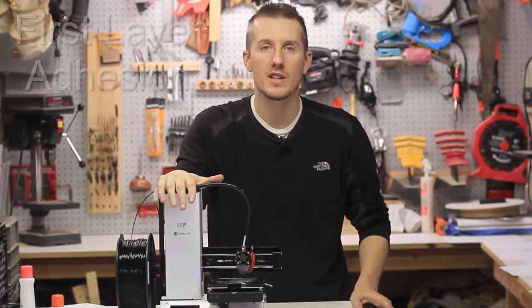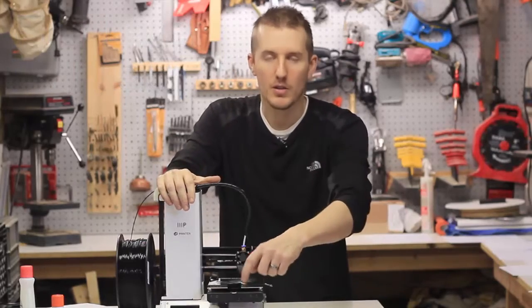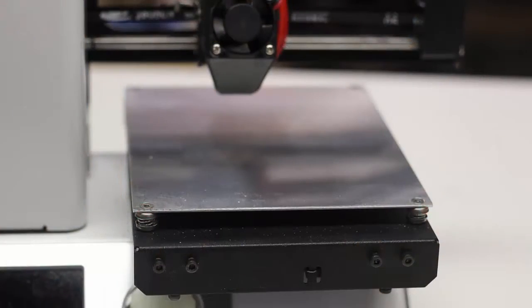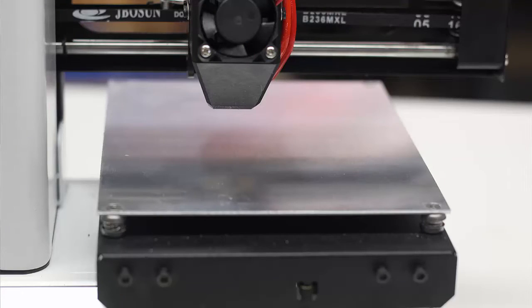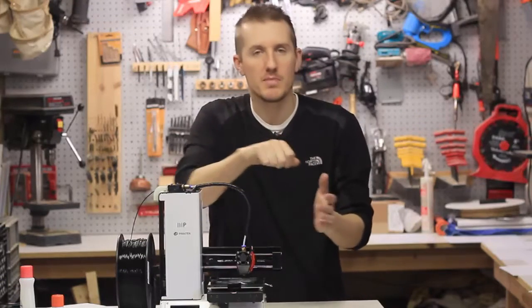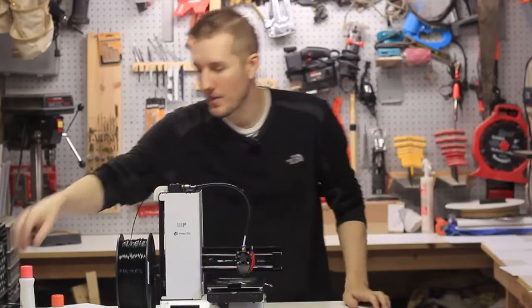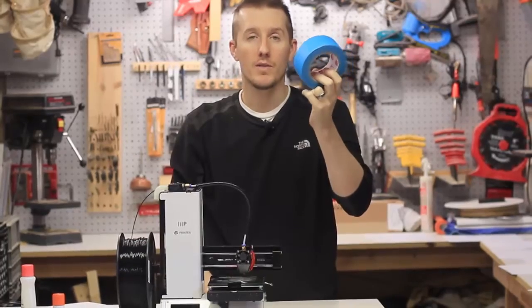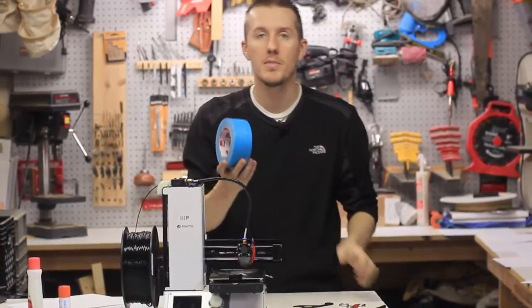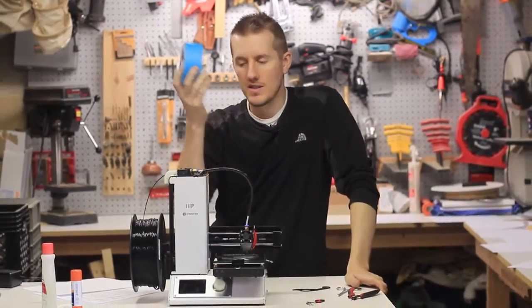One of those is first layer adhesion — you want it to stick to your print bed. Starting off with this printer, it has an aluminum print bed and you'll have white masking tape on there. That's fine for about five or six prints. When you turn on your heated print bed, it'll start to bubble and you'll have to use that spatula and smooth it out. Eventually it goes bad and you replace it with masking tape. This is cheap Harbor Freight blue masking tape — about two or three bucks. At Lowe's and Home Depot it's eight or nine bucks. Some people use that green frog tape.